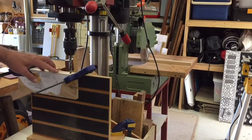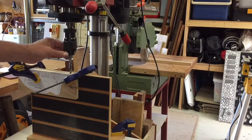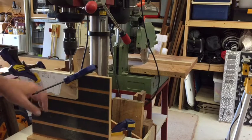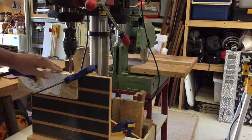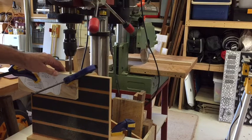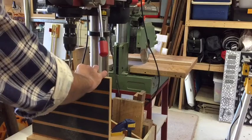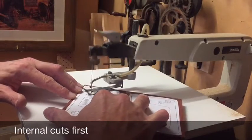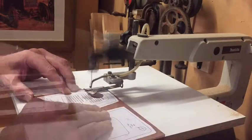So we're going to drill a hole for the tow hitch in the main body part of this little tractor. I always like to drill these holes before cutting out the pattern. The jig is simply a right angle piece with some grip tape on it to help grip it — very simple to make. Simply clamps there and there we go, nice even centred hole.